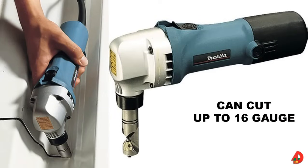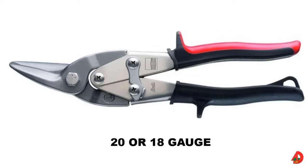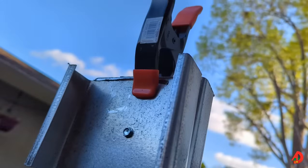There are certain handheld power tools that can cut metal framing members up to 16 gauge. 20 and 18 gauge framing members can be cut with aviation snips. The cut edge of the metal is very sharp; therefore, it is recommended to use angled aviation snips to protect your knuckles.